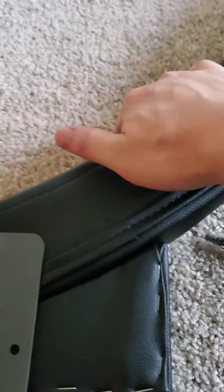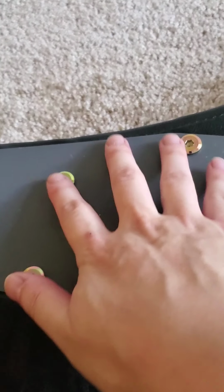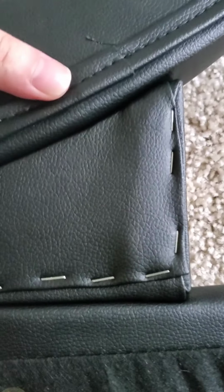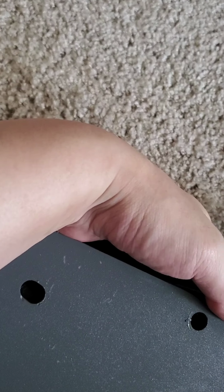And sometimes when you screw this in, try to push this down a little bit and push this up a little bit, so that you can get these holes in the right places that you want. And when there's no gap between them, then you can drill these 2 holes at the very last step. So in step 1, sometimes when you align this middle part, it might be at an angle, it might be crooked, there might be space in between. So you want to put this in loosely, and then make sure that there is a hole here and there is a hole here, because these two right here are the hardest pieces to put in.